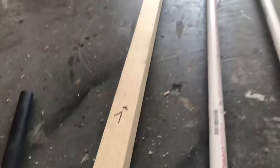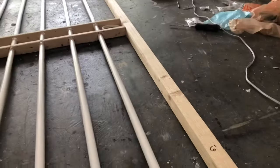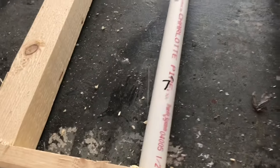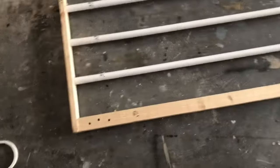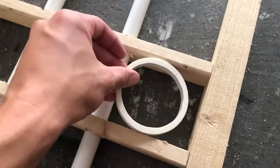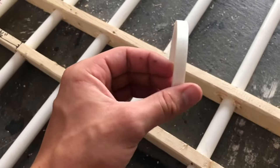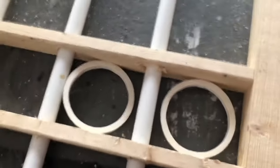This taller two by two is seven feet tall and the shorter one is six feet tall. Each PVC piece goes up by three inches — starting at 6'3", 6'6", 6'9", and finally seven feet. These middle one by twos are both 28 inches; the first one starts three feet from the bottom and the second starts three inches above that. That spacing fits the three-inch PVC pieces cut into small circles that go in between each one. All the holes in the wood are drilled with a one-inch bit, and the bottom pieces aren't fully drilled — the PVC just rests into those.